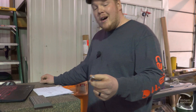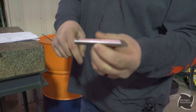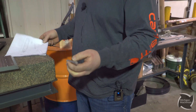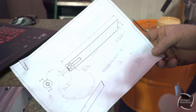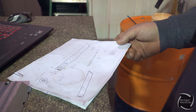Here's the pin we're going to make. We've got 100 of these to make. It's got a little flat down there on a 45, drilled and tapped, drilled and tapped over here — now this hole is clocked to that. We've got a print here kind of just showing the 45. This hole is drilled and tapped, clocked to that 45 angle. Nothing super crazy, but we're going to make a hundred of them, so we came up with this fixture.